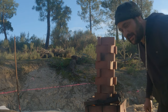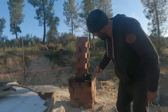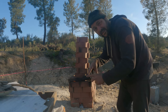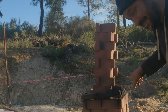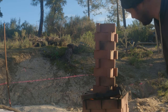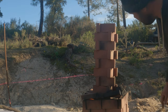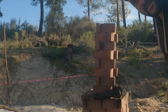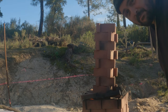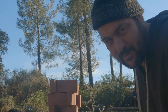I don't want to get too close, but it's been burning for just over an hour and all the wood has gone. It's burning the gases out of the feedstock in the bucket, so it's just gas now. Even 12mm rebar melts — can you see the mess it's in? I can't believe it's standing — leaning Tower of Pisa! I don't know if we're going to get any biochar out of it, but I definitely have to change the way we close the top because all my rebar has melted and bent. I'm going to let it burn out, wait six hours, see if we even got any biochar, and start working on Mark II.